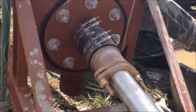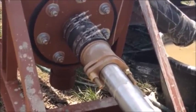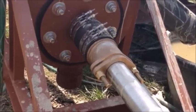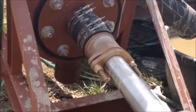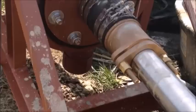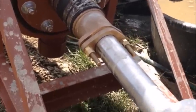This is the back side of the basin where the shaft comes through. We use a stainless shaft running up through the pierce point in the basin so it doesn't corrode. And this is a packing gland that allows the shaft to come through the hole without leaking any water or grit.